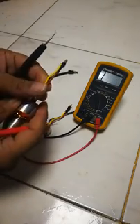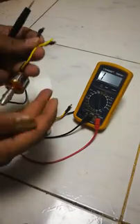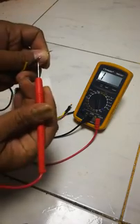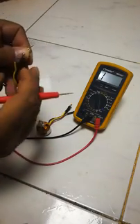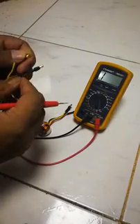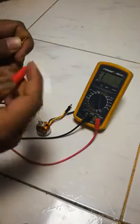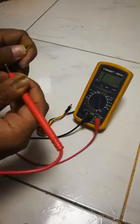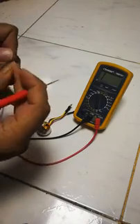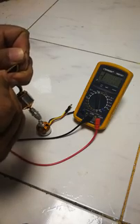This is one of the motors — the bullet connector just broke off. To test these motors, you take any two leads and connect them. They should give you a continuity tone. So I take one of the pairs: the red and yellow on this motor works just fine — you can hear the tone.